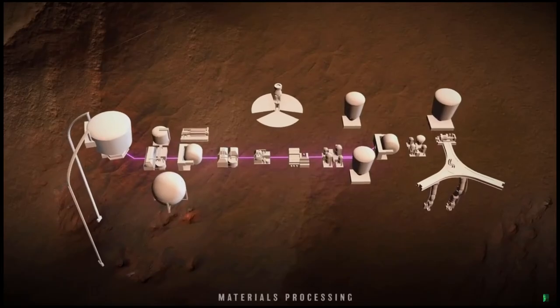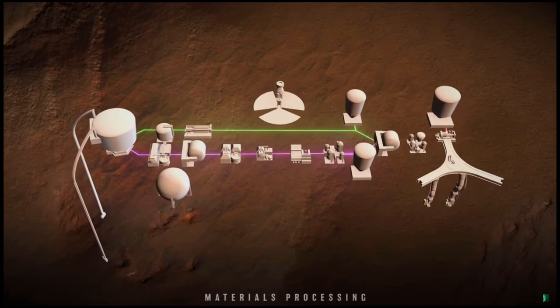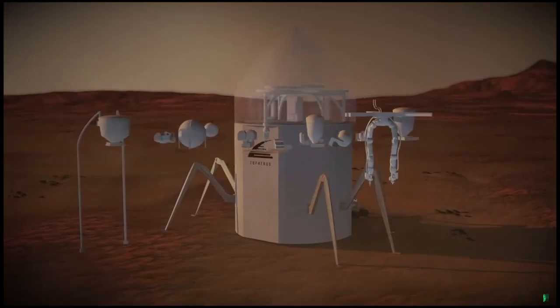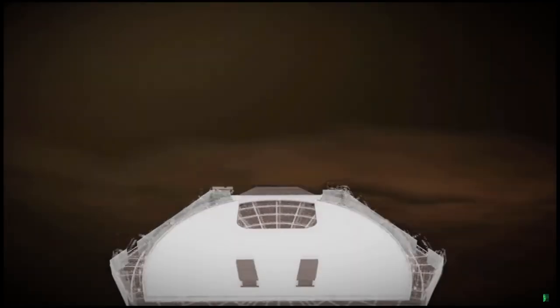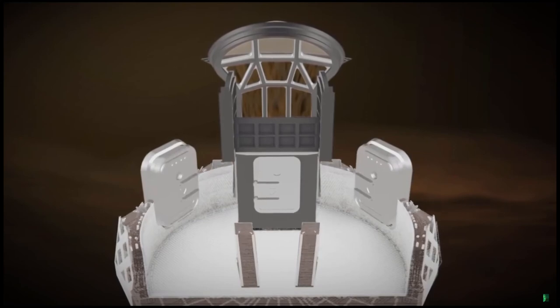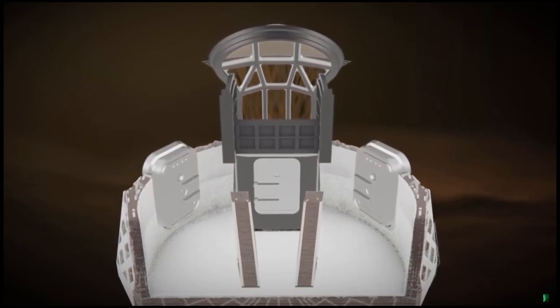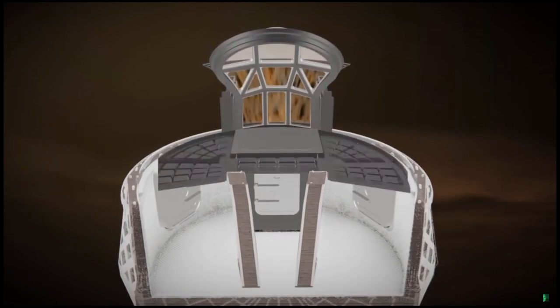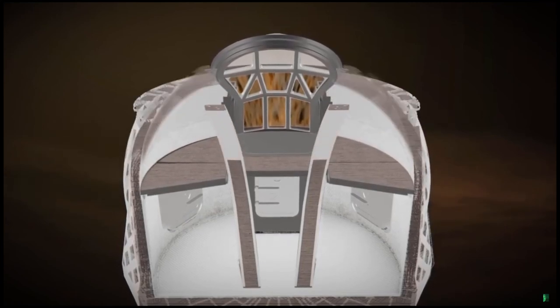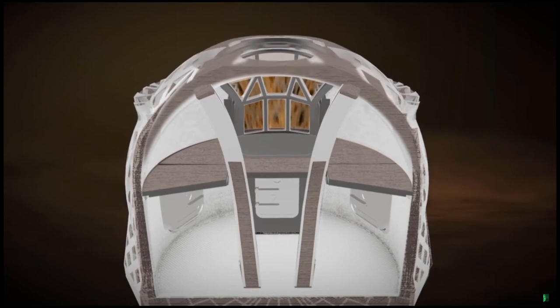Aggregate mixed with cement, derived from Martian carbonates and water, creates concrete suitable for habitat construction. The lander then prepares for the printing phase. Beginning with HDPE, a highly recyclable thermoplastic, the nozzle prints slightly ahead of a second nozzle printing Martian concrete. This method provides the necessary support structure for the 3D print, which enables printing of highly sloped overhangs.